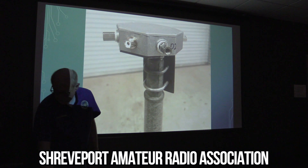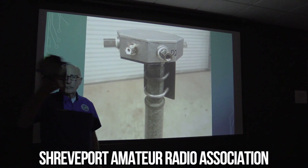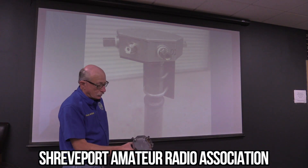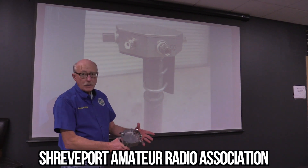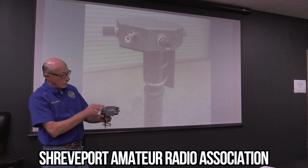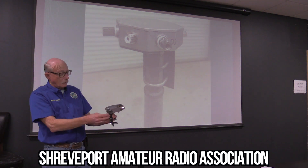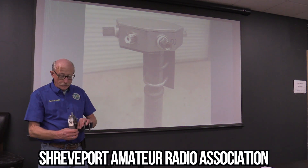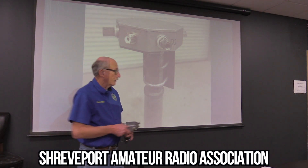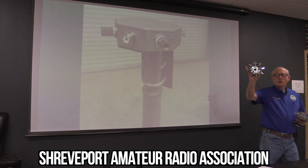Now this is the one that I built. I'll let Phil walk this around so everybody can see it real good. Mine is built for just two bands — 10 meters and 17 meters are my favorite bands. I would put a 10-meter antenna here and it's counterpoised directly opposite, 17-meter antenna here and it's counterpoised directly opposite. Both antennas are driven off of one feed line. It really simplifies things. Jim can do four bands on his.